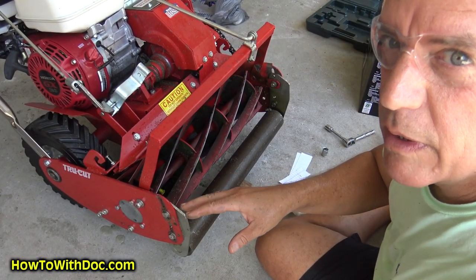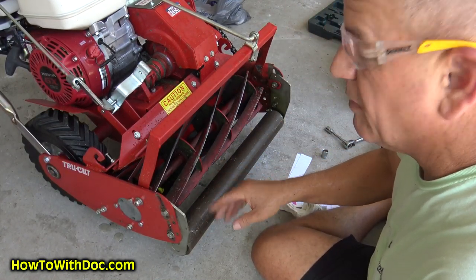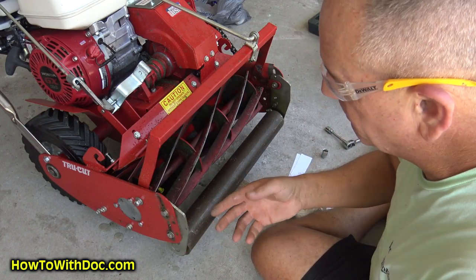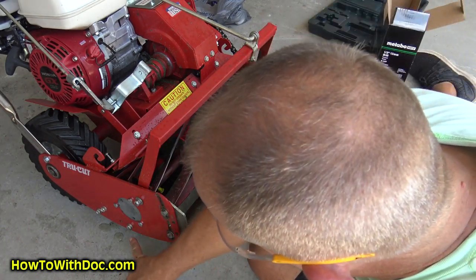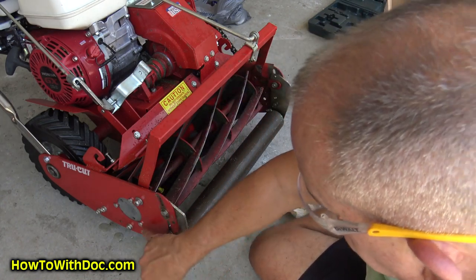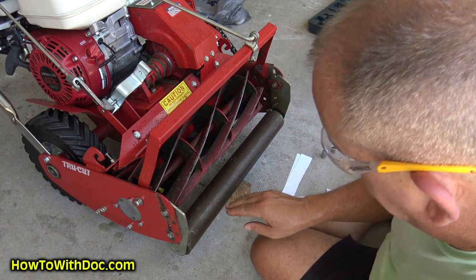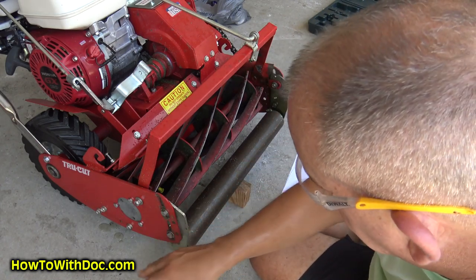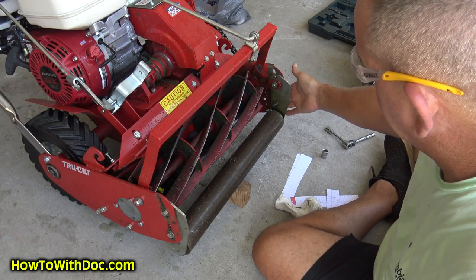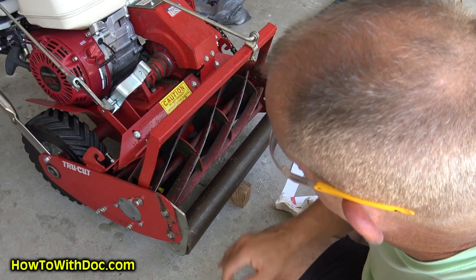Now remember, I tested this several times over here, lapped it, rinsed it all off. Retest it before you cut. It's this bottom third lower bolt — this side, if I tighten this it'll lower this side. If I loosen it, it'll raise this side. Same thing over here. So these bolts play a fine-tune adjustment on a TruCut.